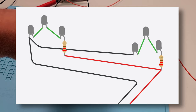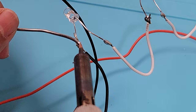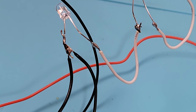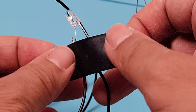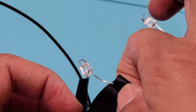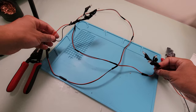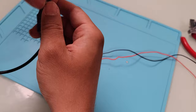For the next step, we're going to take the LED set with only one wire soldered to the resistor and solder a new black wire to the same LED leg that already has a black wire. Now I'm almost done. Before soldering the USB cable, I'm going to protect the connections and organize things by using electrical tape on each leg of the LEDs to prevent them from touching each other, and then tape things together so there isn't a mess of wires. Here is how things look before I solder the USB cable — each set of LEDs will be placed on a corner of my television.